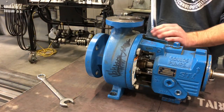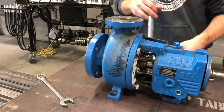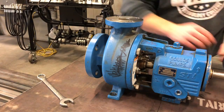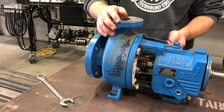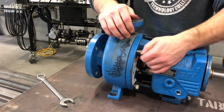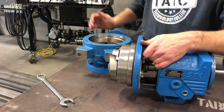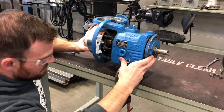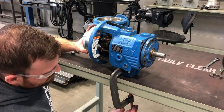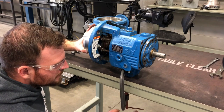There should be four bolts that hold this on. We're going to take the bolts out of the volute. I went ahead and separated them — I was able to just lift up the stuffing box and pull them apart, but you might need to put a piece of wood underneath it so it doesn't fall if this is a bigger pump. After that I went ahead and used the one leg that was left and clamped it down to the workbench so I could easily work from both angles.